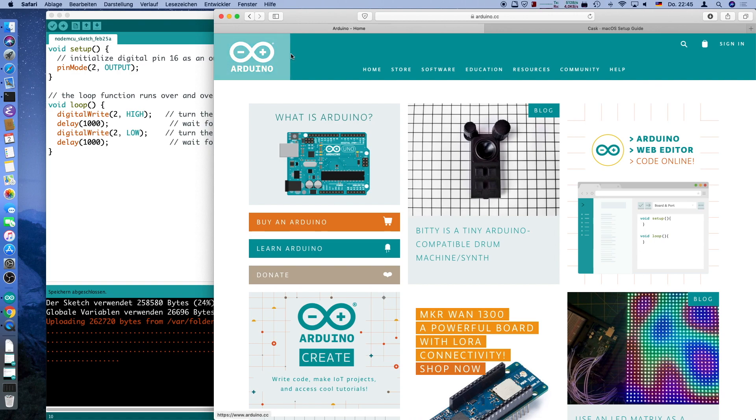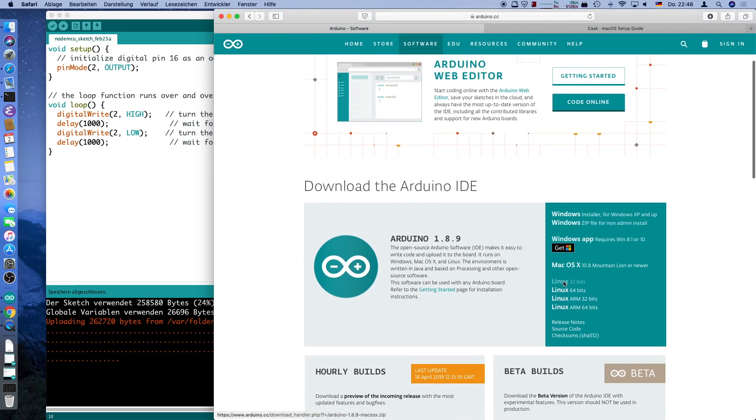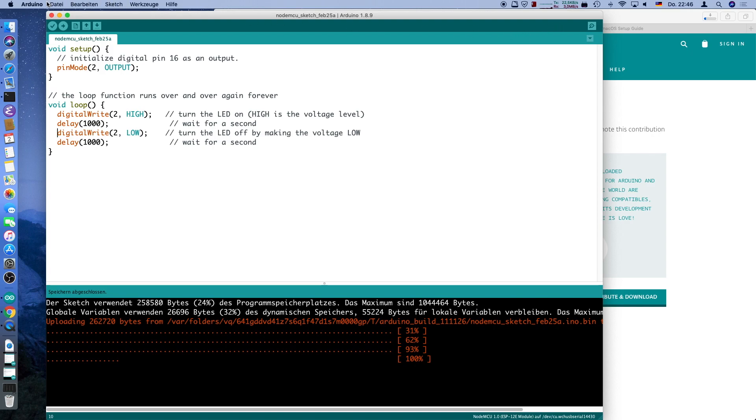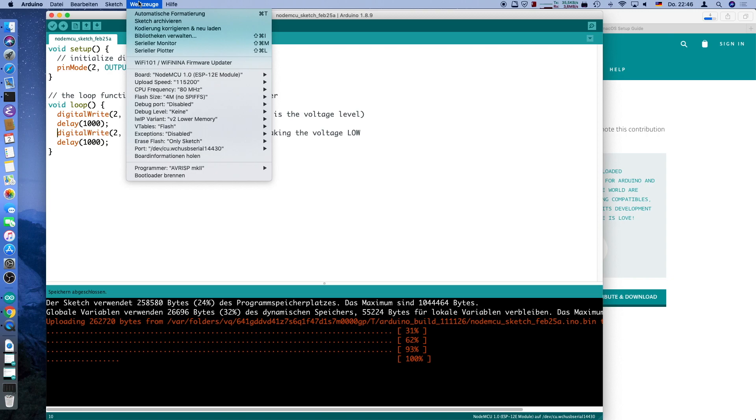Given that you have the driver, go to arduino.cc, then Software Downloads, and download the Arduino IDE for your operating system. The important thing to do next is go to the Arduino IDE preferences and paste a specific URL — if you search for Arduino ESP8266 you will find it, and I'll also put the link in the description. It's a link to a JSON configuration file that adds full ESP8266 support. After doing that, it will download a bunch of things and you will have support for NodeMCU boards and others.